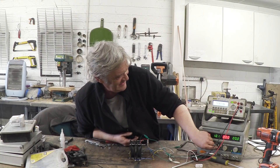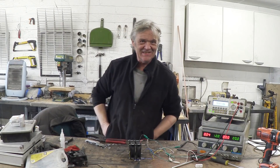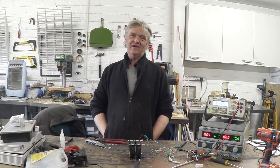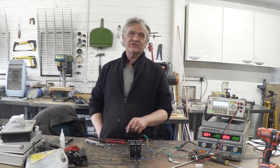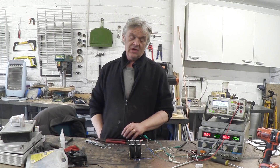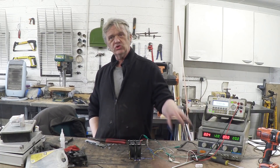And she's off. We're putting 12 volts DC into that and off one phase getting 15 volts AC out of it. You can hear it — it's really quiet. That is going to last as long as those bearings, so for years; it's going to run for absolutely ages. It'll be surprisingly efficient because we've removed all the blades, so it's doing no work apart from that transformation of DC into AC. Obviously, if you get an AC load, it'll pull more on the DC because of the conversion, but it's going to be really efficient.